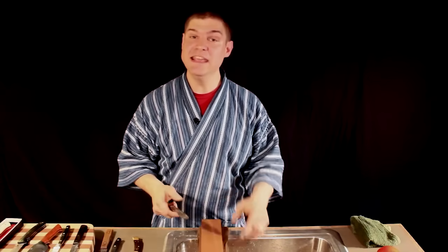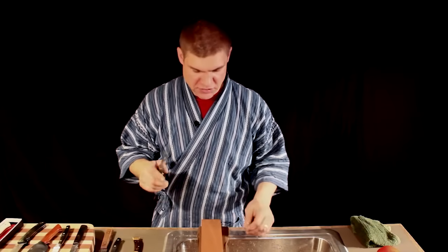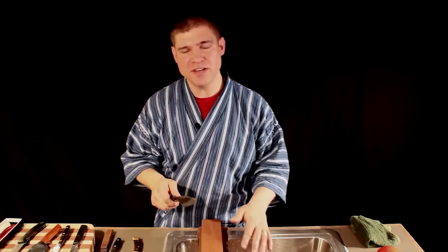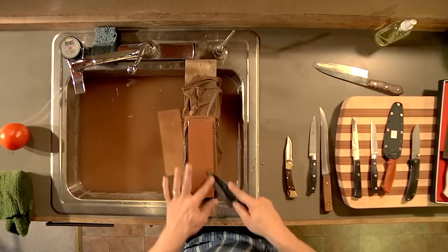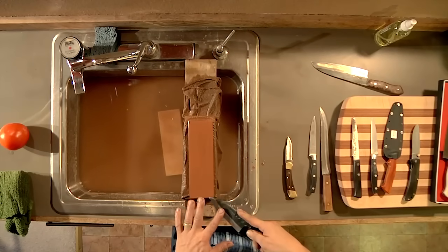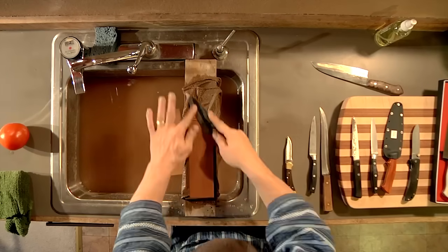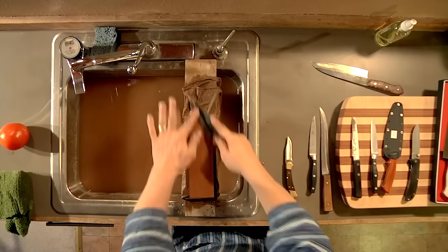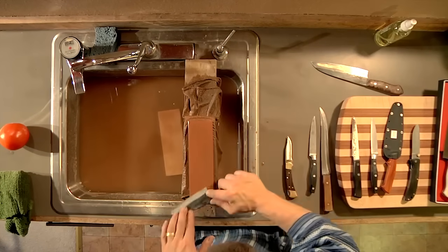But do you know what would happen if you put your blade into a sandbox and moved it backwards hundreds of times? It would sharpen the blade. So to get the blade 5 times sharper using the same stone and using the same angle, we're going to strop backwards from tip to heel, 5 times each side. You can do 5 times this way without changing hands, without changing your grip. That'll actually help you maintain a nice angle.